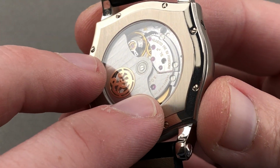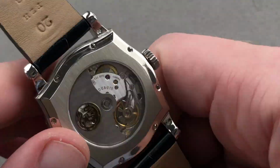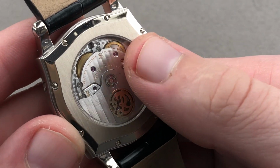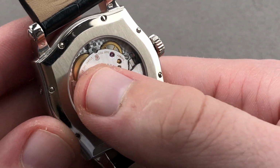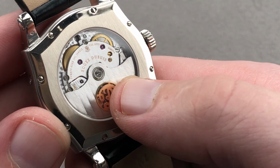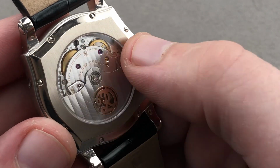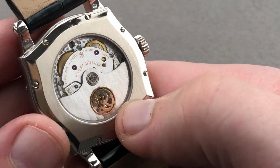5-position chronometer style adjustment, it pivots on 29 jewels, and the movement, which is a unidirectional winding automatic with twin mainspring barrels and a 44-hour power reserve, it's based on the Longines L990. Also known as the Breguet 8810 and 8815. It is a movement originally developed in 1977 by Longines, and its twin barrels ensure a very even torque release from max wind to minimum wind, so it doesn't have the huge drop-off in amplitude after 24 hours that you get, for example, in a similar power reserve Rolex 3135. There's not a big difference in power reserve between these two movements, but the twin barrels make this one a better timekeeper over the full duration of its power reserve.